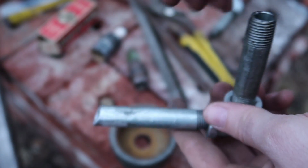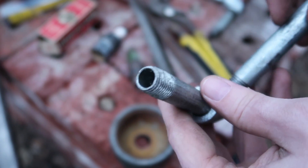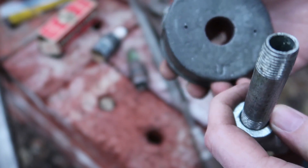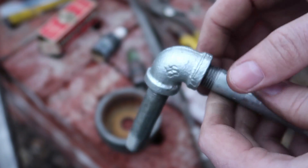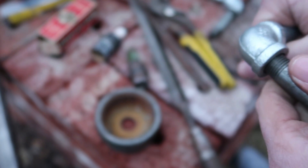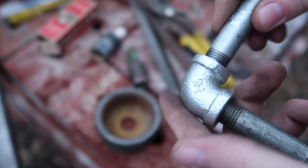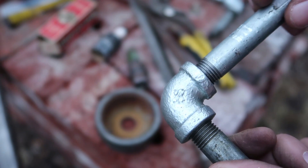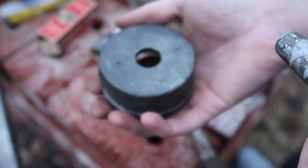Something to keep an eye out for is oil — a lot of these new pipes have oil or grease inside them to prevent rusting. I will definitely need to remove that because in a 100% oxygen atmosphere that might catch on fire and could cause a huge problem, possibly blow up my tanks or even kill me. I might do a mixture of degreaser and then heat to clean them. I have looked into Teflon, and evidently Teflon does not burn well in high oxygen — its auto-ignition temperature doesn't change much — so I can still use Teflon tape on all these fittings in a 100% oxygen environment. I haven't looked up kerosene compatibility yet though.